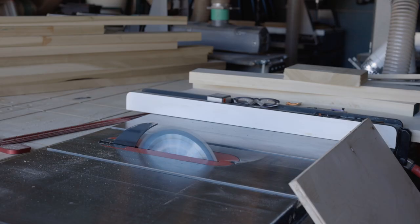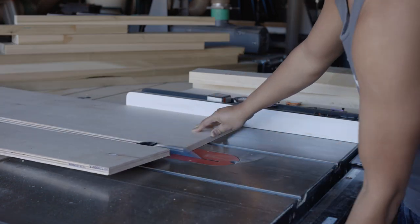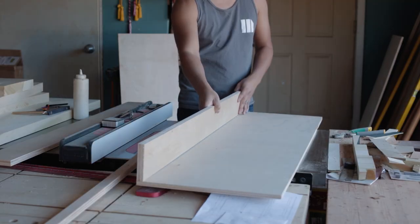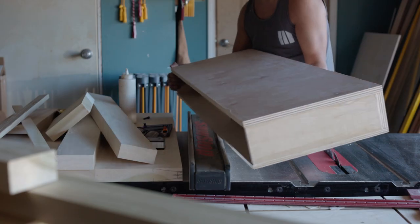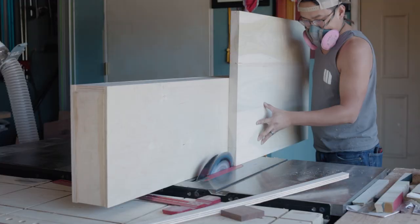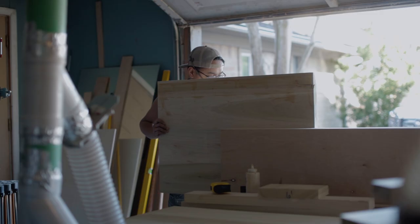Some might notice I don't have a router table in my shop — it's always been on my to-do list to create a router table in line with my table saw, but I never got to it. Because of this, I needed to make a tall enough fence to help support the panel as I create the angled portion of the raised panel on my table saw. Even with a router, the depth of angle I wanted to create for my panels was not available with any standard raised panel bit that I saw. This method does leave some burn marks, but they're easily cleaned off with a hand plane or sanding.